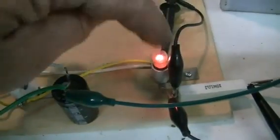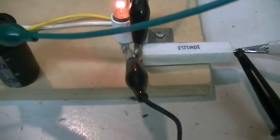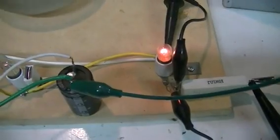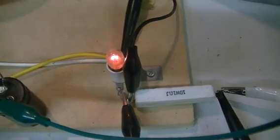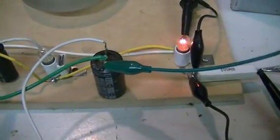We've not changed the positions of anything here. Channel 1 is always measuring the voltage across the globe. Channel 2 is always measuring the current flowing through that globe. Using CVRs on the input to measure power within a pulse motor system does not seem to work, and it wasn't working for me. That is why I fitted this globe and just found what I found. Interesting stuff.